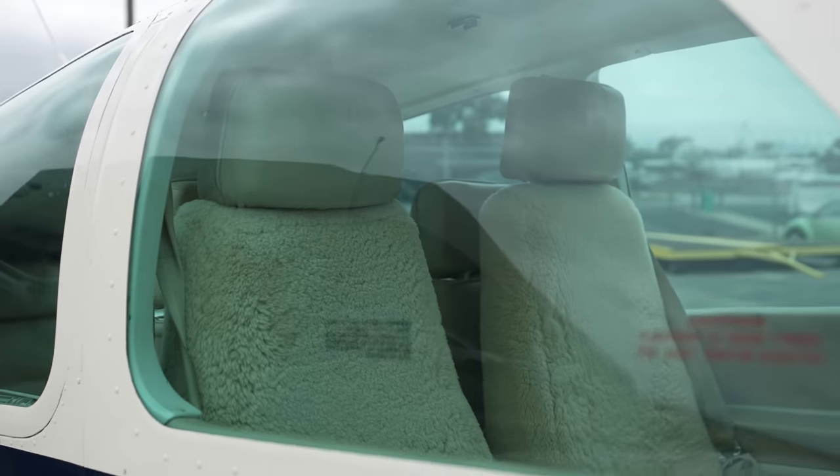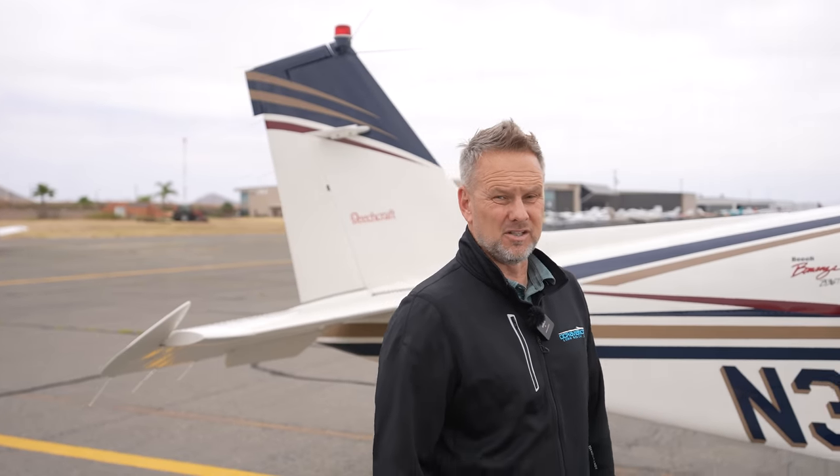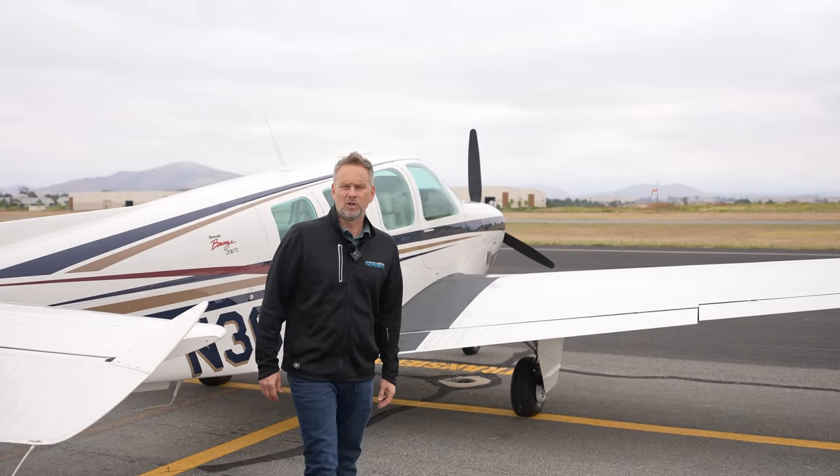We just finished up breakfast at the French Valley Café here at French Valley Airport in Temecula. Really good breakfast, great airport — been here many times. The 1998 Bonanza B36TC — that was a great flight. It was an IFR flight using that old KFC 150 autopilot with the new G500 and GTN 750. Once you figure out how those buttons work, it actually was very, very nice — it worked really well, shot the approach down coupled. The go-around could be a little bit of a challenge, but I'd stick with that autopilot. I don't think I'd spend a lot of money upgrading it; I'd probably just go to the GFC 500 at that point. But the way it's working right now, I wouldn't touch it. I hope you enjoyed the video — thanks for watching.